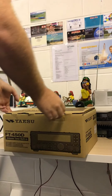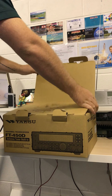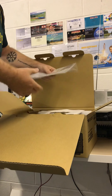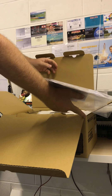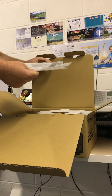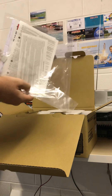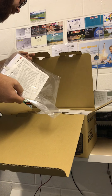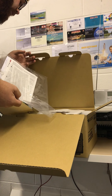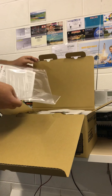It does what it says on the tin — it's a Yaesu FT450D with built-in antenna tuner. Inside the box you have your warranty card which you can register on Yaesu.com. There is a serial number on the side of the box that you enter along with your email address to set up the warranty. Now the warranty doesn't protect against SWR damage. The transceiver runs at 100 watts as standard, so if you are setting up an antenna for the first time I would strongly recommend putting a dummy load onto your radio and testing your SWR that way, otherwise you are going to do some damage and it's not covered under the warranty — that's your £650 down the drain.